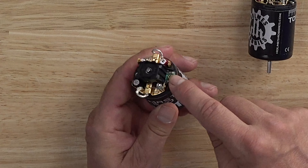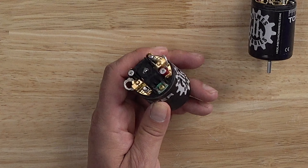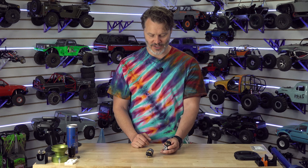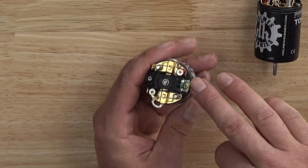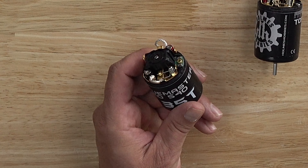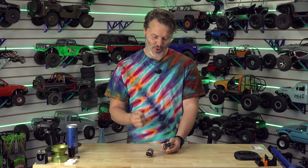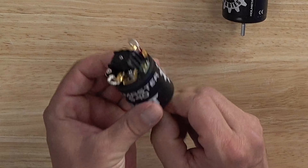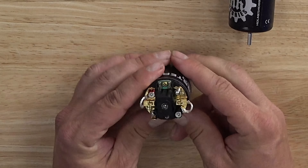They do have these little heat sinks, which look cool — get a little heat sink action there. We also have this PCB on it that filters out a little bit of noise. Back in the days of AM radios in particular, and even FM radios, these were very necessary. We still put them on there just in case. These days with 2.4 gigahertz, we really don't need these, but they do offer a little bit of suppression of the ablation — sparks, you would normally call it. The ablation of your brushes and your commutator will sometimes happen when you have a start and stop. They help a little bit, but it's enough for me to keep them on there.